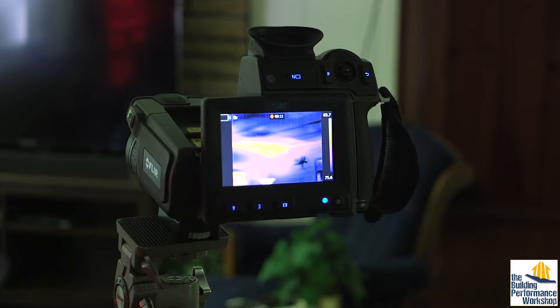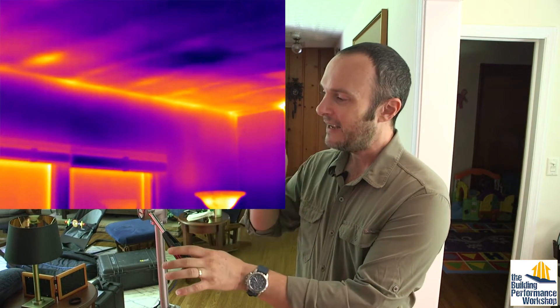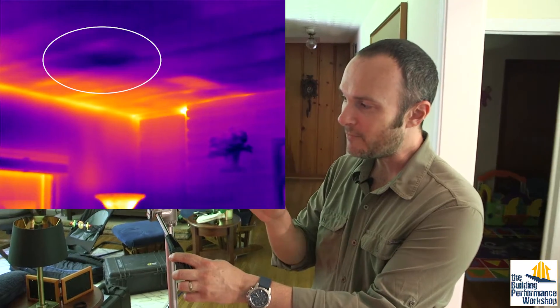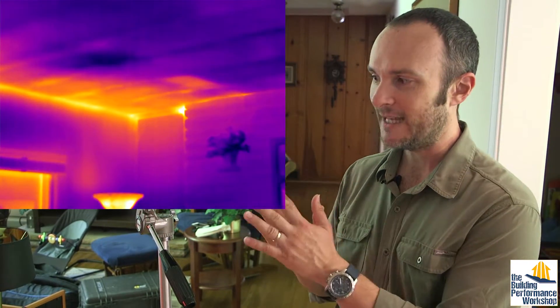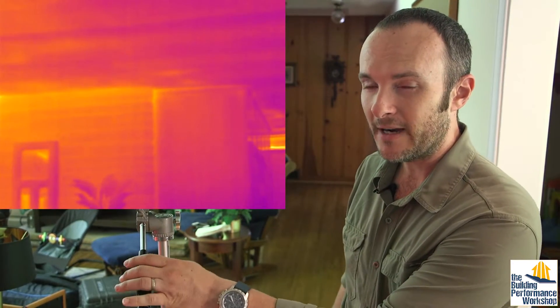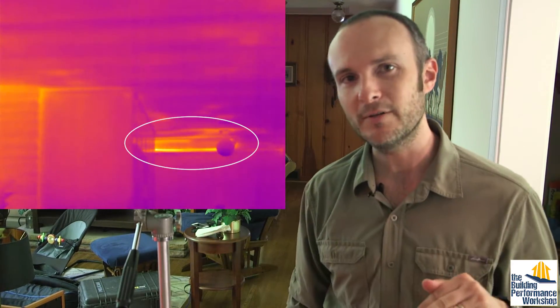You would do this for the entire enclosure — all exterior walls. I'd start at the front door and move clockwise on each floor. We have windows — don't look at windows with infrared. We have what looks like a heat bleed problem up here — that's definitely an insulation issue. Something that might be a moisture issue — anything I flag as moisture, I'd immediately use a dedicated moisture detector to verify. We also have the fireplace, which should show up as air leakage, and the attic access is already hot before we even run the blower door.